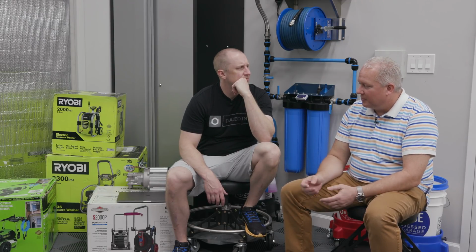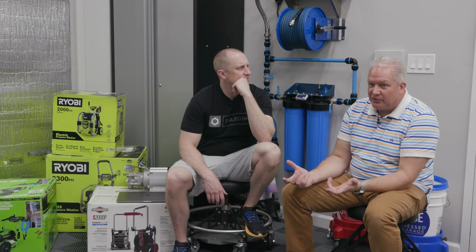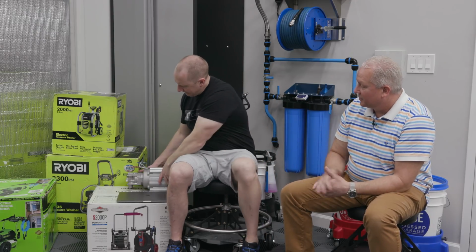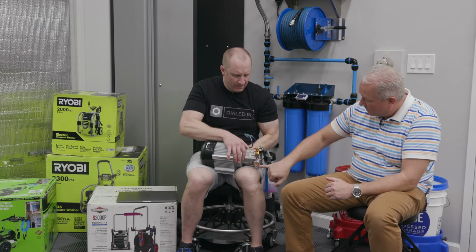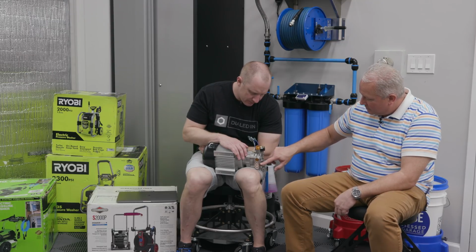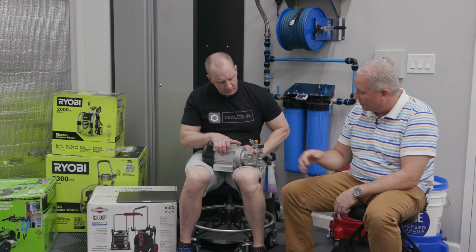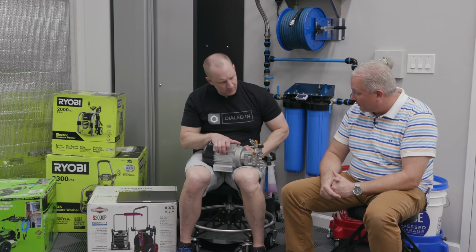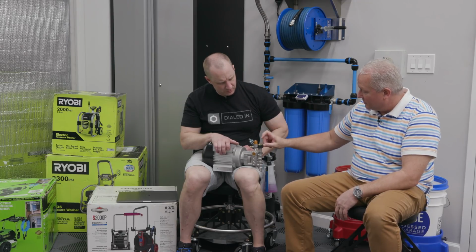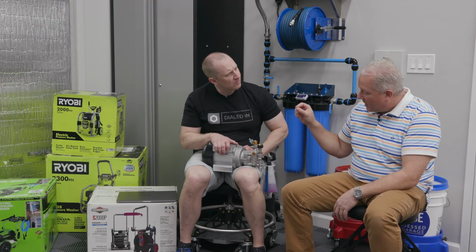So the way that the PW101 is, we have digital pressure sensors. We have the motor over here. It's plumbed right into the manifold on the head of the pump. And the pressure sensor sends a signal up to the receiver, which is downloading the data into the computer. And again, that's accurate within 1%. And then same thing on the inlet side where your garden hose is hooked up. There's another flow sensor that's sending that data back to the computer.